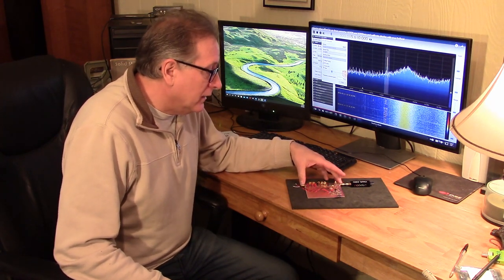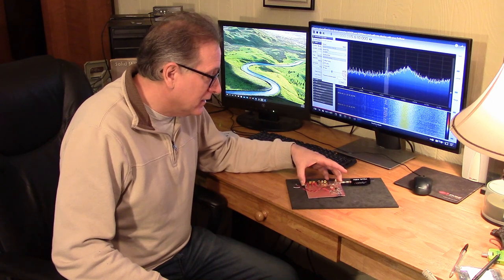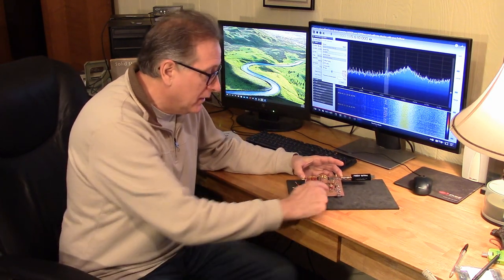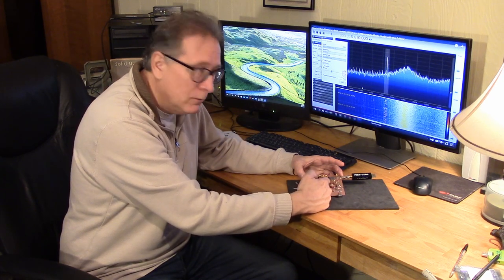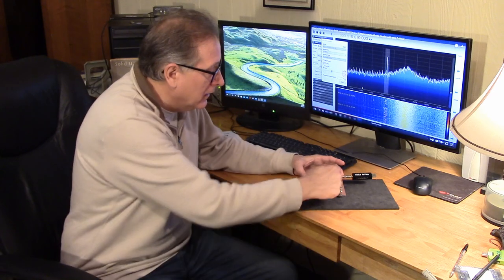So welcome back to the HF Upconverter video series. And I did want to show something to you guys before you lost interest. I've taken just the basics and put it on the board so far. Here is our original oscillator that we developed, and I have a front-end filter that we will develop in this video, and then the simple passive mixer going into the smart RTL dongle, and that represents a basic first principles upconverter. This would work as is probably between 160 meters or 1.8 megahertz up to probably 30 meters without any other modifications. This would work fine for that band.